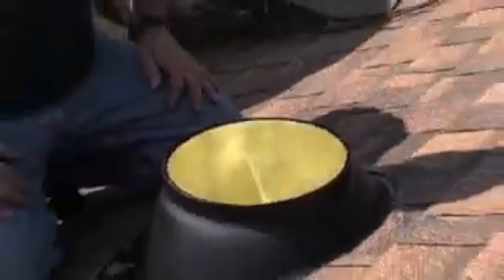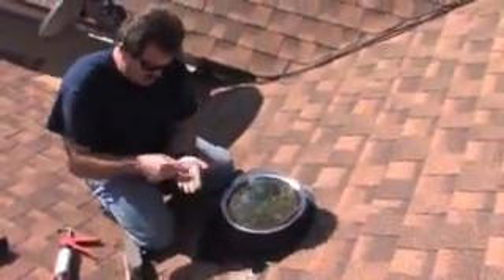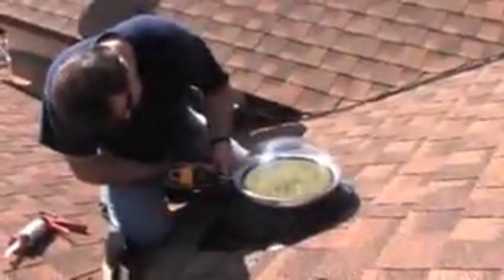Now we're ready to put the pipe back in. Here's my reference mark — I want to line it up with the one on the flashing. At this point we're about done on top. All we've got to do is take off the protective film and put the dome on. We're going to attach the dome to the flashing with these four little stainless steel screws. One thing — you never ever want to seal around the trim ring. And we're done on the roof.